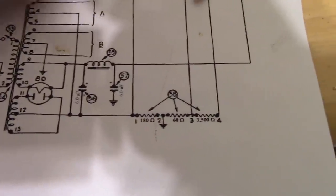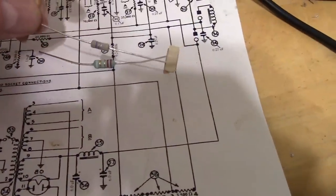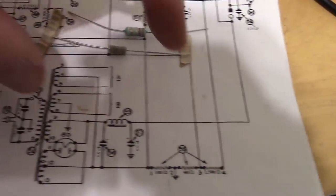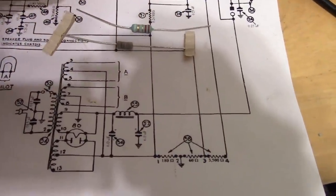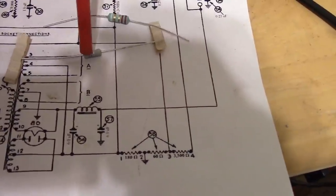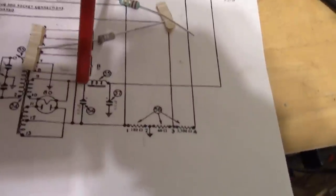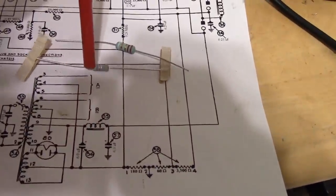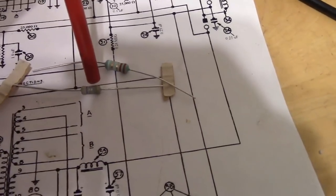Now these are fusible resistors, the modern type. You may have seen old ones, and they're big, they're huge things, they're very common in series strung TVs. Well, those are the modern version. It's 2.2 ohm, 4.7 ohm. If there was a dead short in a radio, these would blow out fairly quickly. They're designed to blow out safely. They're flame proof, in other words.